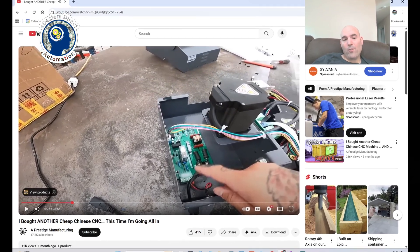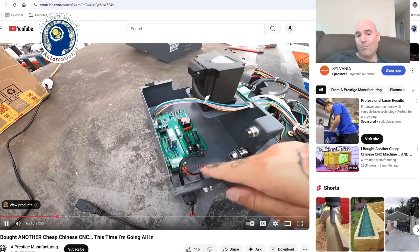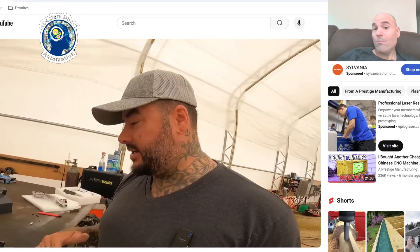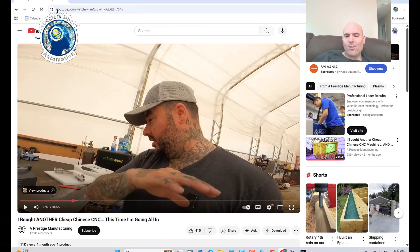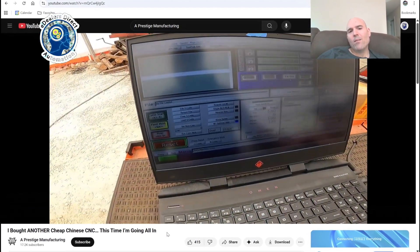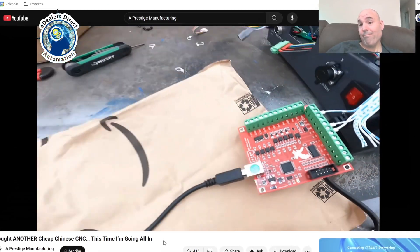We'll play it from here so you guys can see inside the controller. This is the torch height controller, so I'll get rid of that. This also leaves a lot of area in here if we need to add something. What's really crazy is the drivers for these little servos are all built onto one small board. Of course, these are not servos — they are steppers. When I hit reset, the light goes solid, so you know it's communicating.